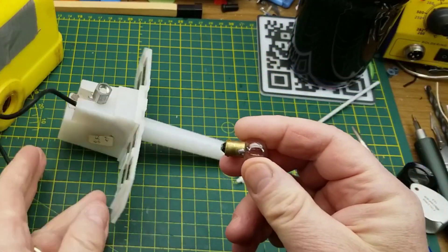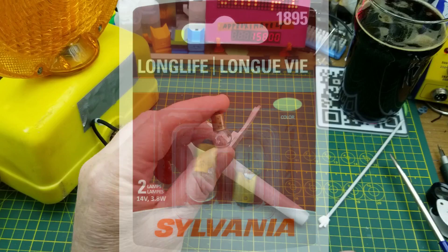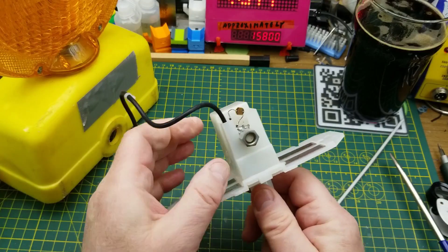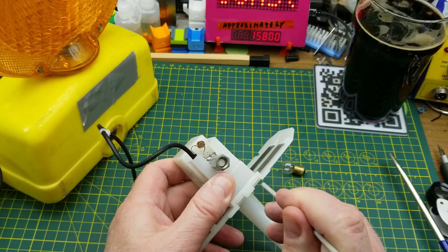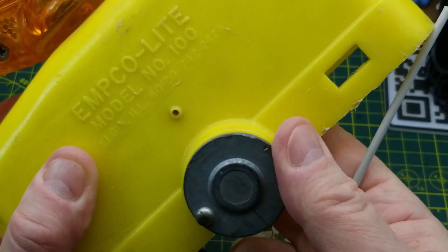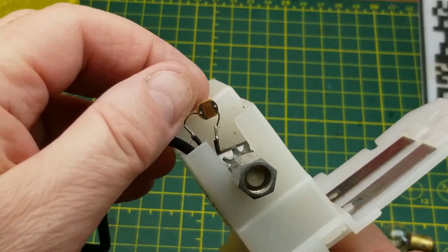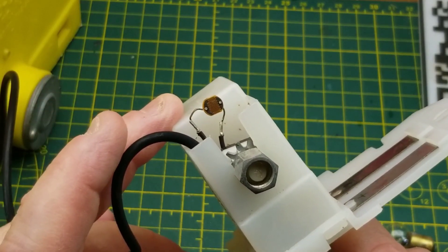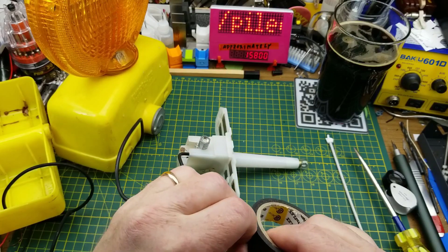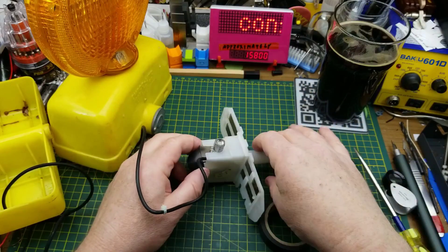Let's get the bulb here — it's just a simple little DC bulb, W1895 for the light bulb aficionados in the crowd. That just bayonets onto there. Then we have a little push button here which turns it on and off, accessed through a little hole in the case. So the entire thing is fairly well weatherproofed except for that one little hole right there. Behind that switch, there is a little cadmium sulfide type photoresistor so that this thing only runs when it's dark outside.